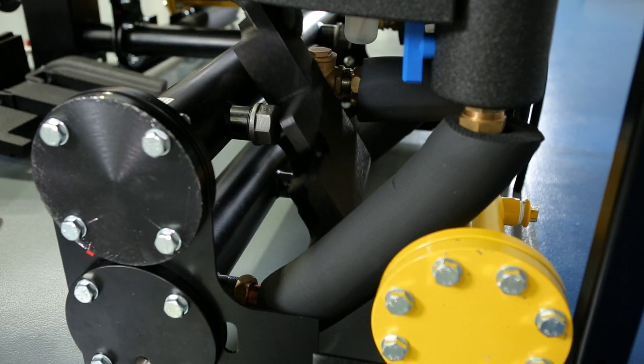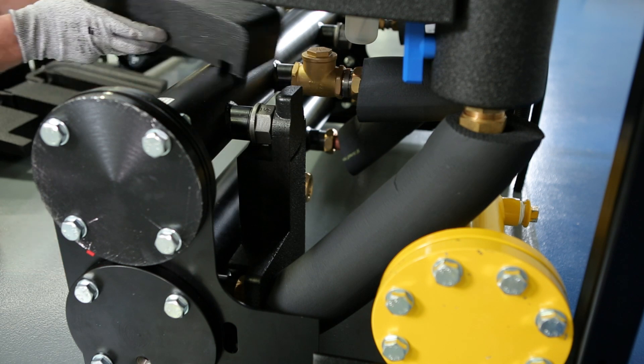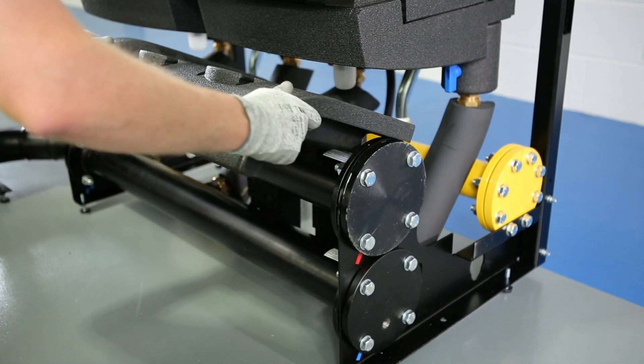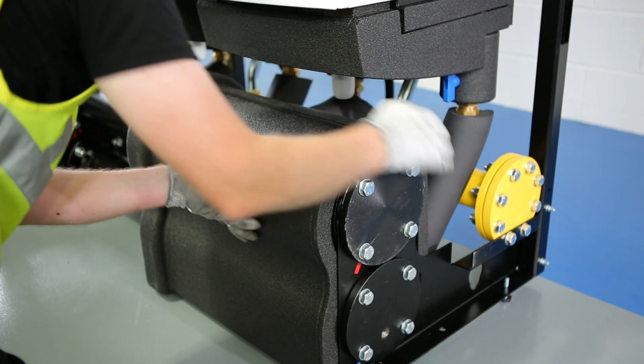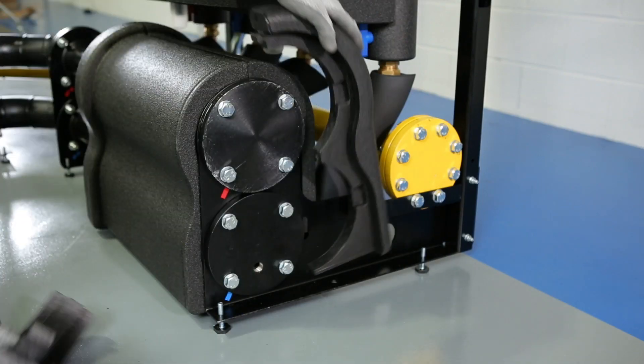To fit the insulation, place pieces one to three onto the back of the pipes and lock together. Then add the fourth front piece and final pieces to the flow and return pipes. Repeat this process for the entire assembly, finishing with the end piece.